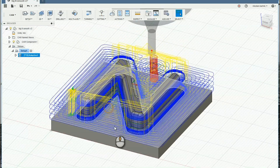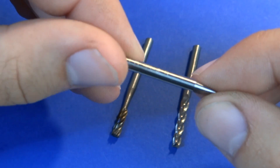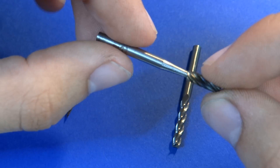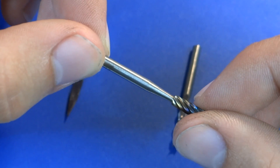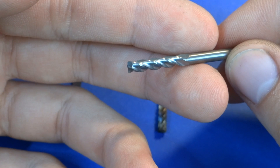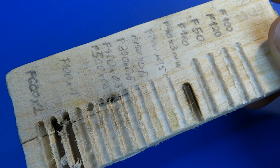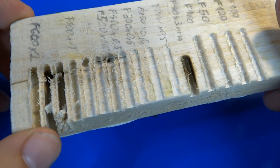Once you're done with post-processing, you can open GRBL, open your G-code, and we are ready to mill. Of course, remember about safety glasses — they are very important; you don't want to get any injuries while machining. Besides the T8 CNC machine, you'll need a milling bit. It's important to use proper milling bits to cut wood efficiently. For example, an engraving bit is impossible to mill with. A milling bit from a Dremel tool is also not perfect for CNC machining. The bits I'll use in this video are 3.175 millimeter flute milling bits — they work perfectly with wood. My recommended values are 600 millimeters per minute feed rate and 2 millimeters cutting depth, though you should find your own best values according to your machine and tool.